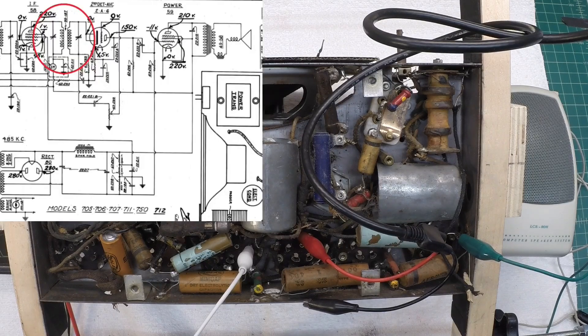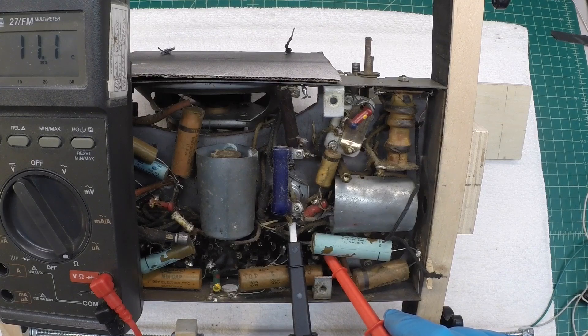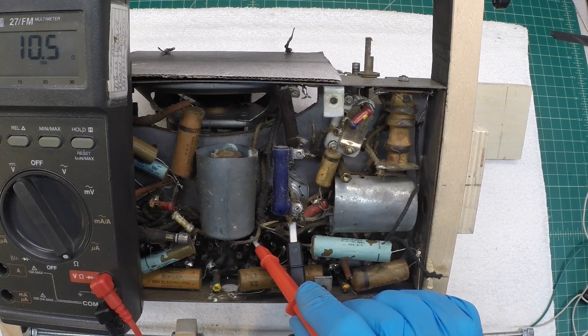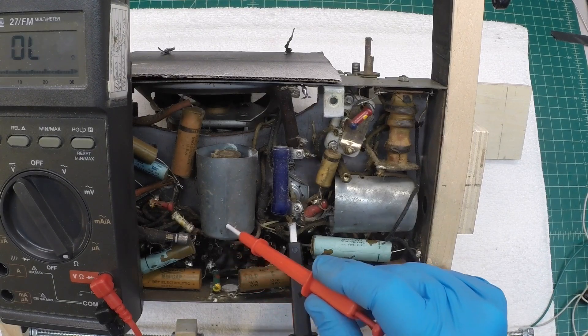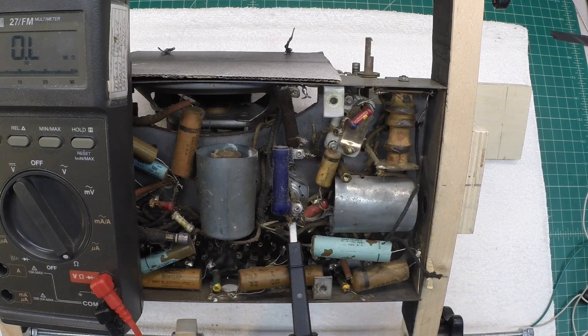You can refer to the picture-in-picture here for my connection points. I'm rocking the dial and you can hear very little difference. I believe I have the primaries of the first and second IF transformers identified here — 11 ohms on one, and right at 11 ohms on the second. You can see I'm really struggling on that second IF transformer to measure the secondary output. Everywhere I've traced so far, it appears to be open, and that coincides with using my signal generator and trying to push a signal through it as well.